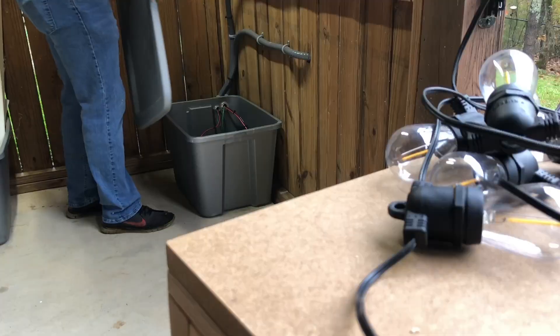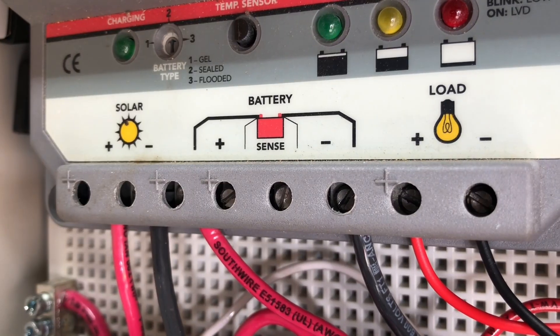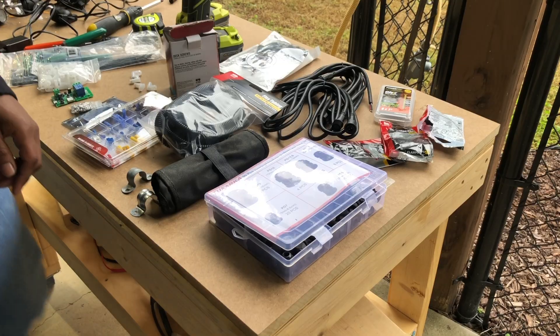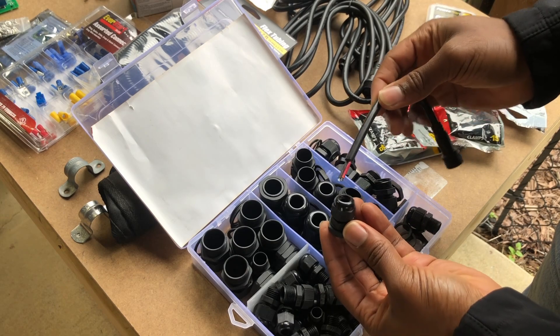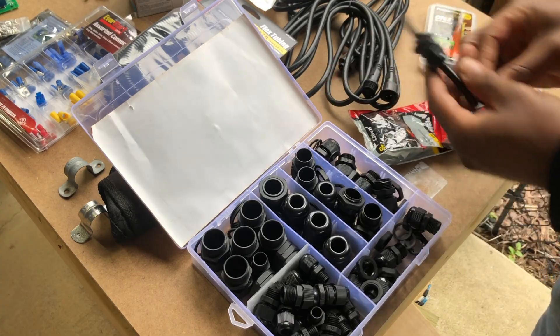Due to space requirements, I decided to install my LED string lights pigtail cable in my electrical tote, which is currently used to house my 12 volt battery and wifi relay. Note, if your charge controller supports it, you can also wire these lights up to your charge controller's load terminals. Next, I needed to find the proper sized cable gland for the new cable I will be installing for the string lights, to help keep water and debris out of the tote. I will leave links for all the major components used in this video in the description.